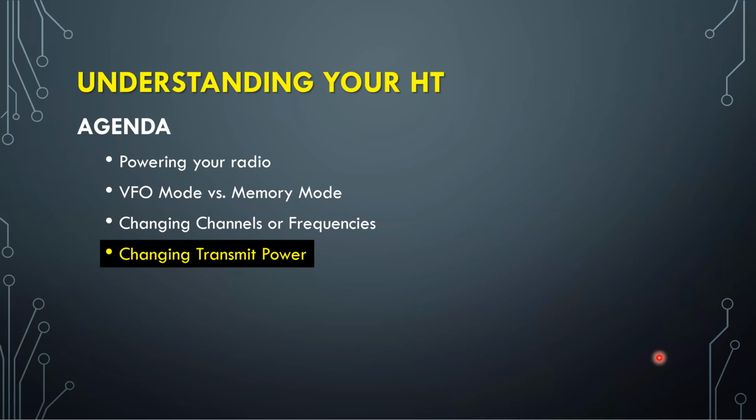There's an FCC rule, and I'm going to let anybody who knows what the rule is that talks about your transmission power. Our responsibility as ham radio licensees is to do what? The lowest possible power. Say again? Just the lowest possible power. Correct. Use the lowest possible power that enables proper communication, right? If you're using 300 milliwatts and I'm only catching every other syllable, I need to go a little bit higher, right? But if I'm on a simplex channel, extra credit, what's simplex? Okay, so you are talking to somebody, you're not using a repeater, you're using the same transmit frequency as your receive frequency. That's called a simplex channel, okay?